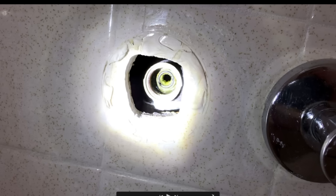Look at that circular portion — this is called your seat. If your seat is badly damaged, corroded, or has sharp edges along the face, it is no longer going to create the watertight seal that is required. If you have a very damaged or corroded seat, you have to replace it. It's a simple process — there's a link in the comments to a step-by-step video, and the tool you need costs about seven to eight dollars. Important: if you replace the rubber gasket and it's still leaking after reassembly, the seat is probably the cause.